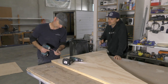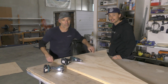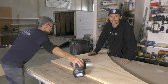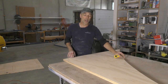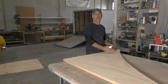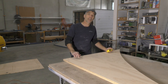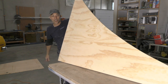Kragos is pre-drilling and then using his 24mm stainless steel countersunk screws, making sure it's flush at the bottom so both pieces are exactly the same. We're measuring up 900mm — three feet — and cutting the back of the ramp on a slight angle rather than square, so when you hit the ramp there's less chance of it kicking up at the back.